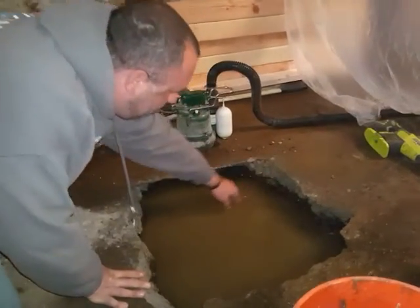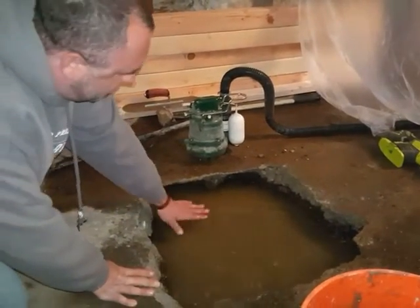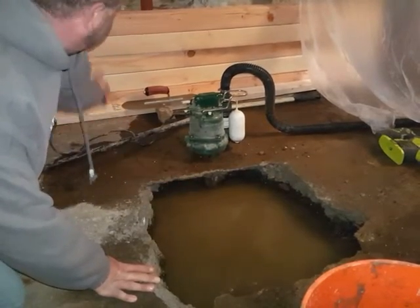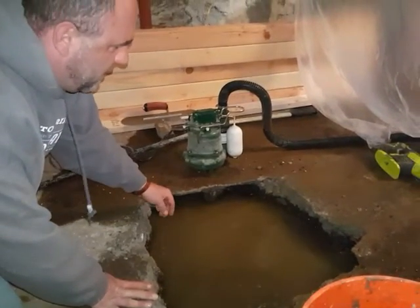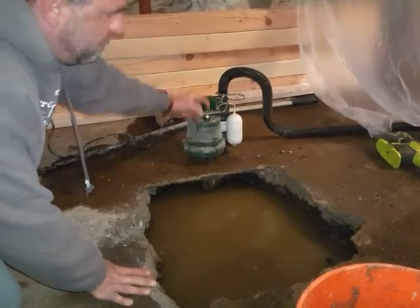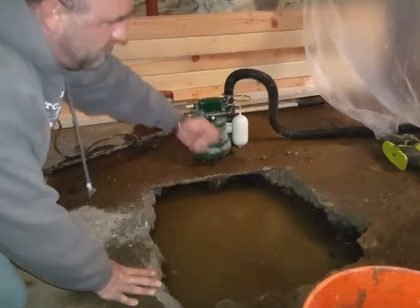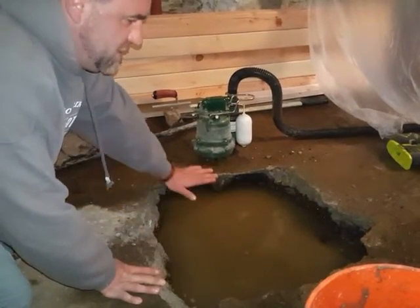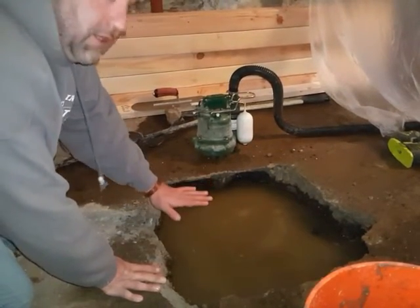You can see the natural water table is about an inch and a half to two inches below the floor. Once it gets to the footing, it's already too late — the hydrostatic pressure will come from the wall. The big thing is that this pump is going to continue to pump constantly, whereas with the ion system it can be monitored digitally according to what we set it at.